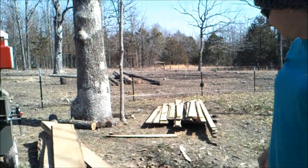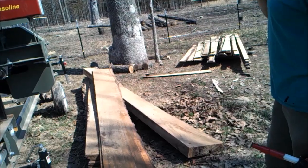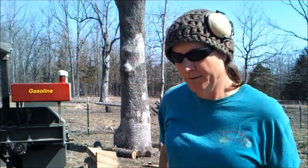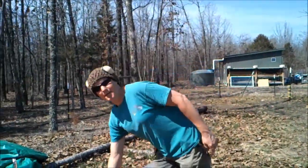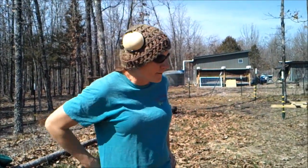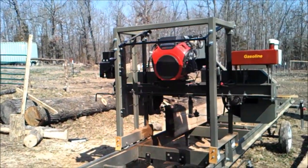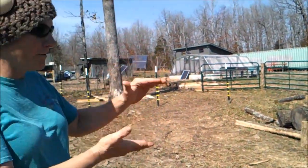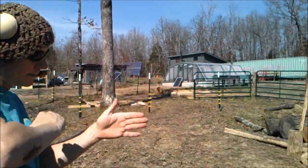I mean, look at this. We got some beautiful wood. Beautiful, serious barn wood coming up here. Even though it's blackjack and it stinks to high heaven when you cut it, it's pretty. It's beautiful. All right, so now it's just making 1x4s. Yep. Which are going to be 3/4. So clean off this bark section here, and I'll just go down to a certain point. And like I said, we'll use the lower portion of it as a backstop to put all those 3/4 boards on edge and slap them off.